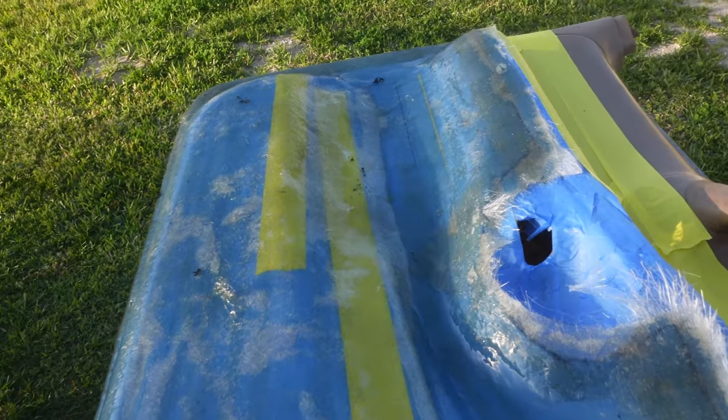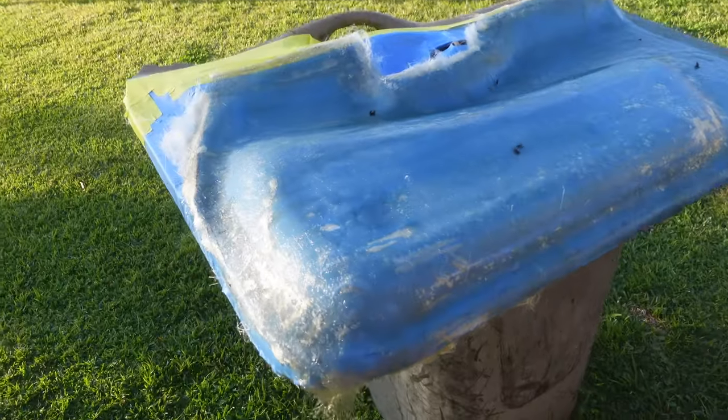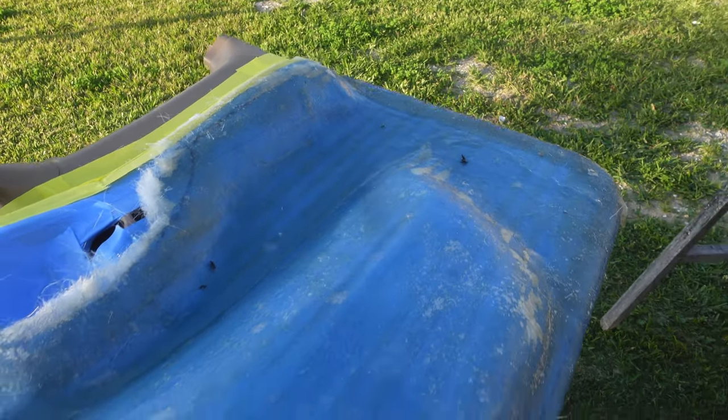For tomorrow's video we're going to be taking the molds off the door panels, removing the tape, and giving them a bath in acetone to get any residue off. If there's any stickiness, it's from putting a little too much MEK, but we backed off on the MEK because of the wind making it react faster. We mastered the measurement so we had enough time to work with it. After the acetone wash we'll be cutting the molds out and giving them a shape. At the same time, we'll be looking at the truck these door panels are going on and cutting metal for clearance for the tens.